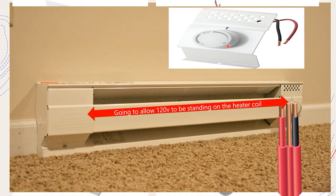Typically on these 110 volt thermostats there's not a positive off dial - you just drop below the desired thermostat temperature and it shuts off. Well, if there is no positive off, at some point this thermostat, when it gets cold enough, it's going to turn on. If it's in the middle of summer, it's not going to turn on and you may carelessly set some boxes, bags, magazines in front of it, or hang some coats nearby. If you're not paying attention in a room you're not in very often, you think the heater's off - it drops below a certain setting, it's only breaking 110, and it accidentally turns on.